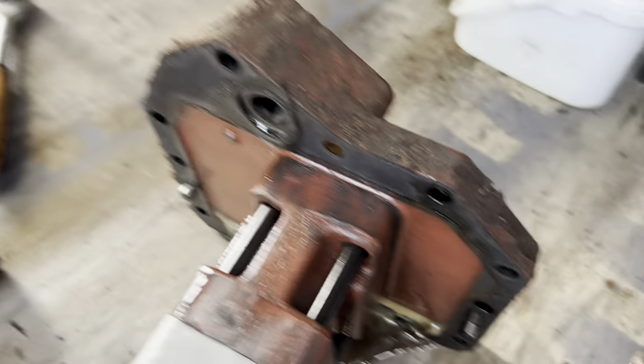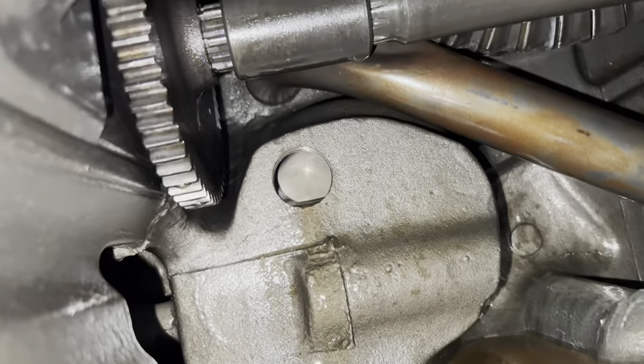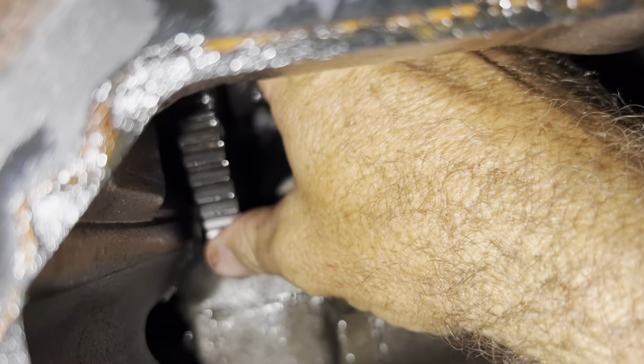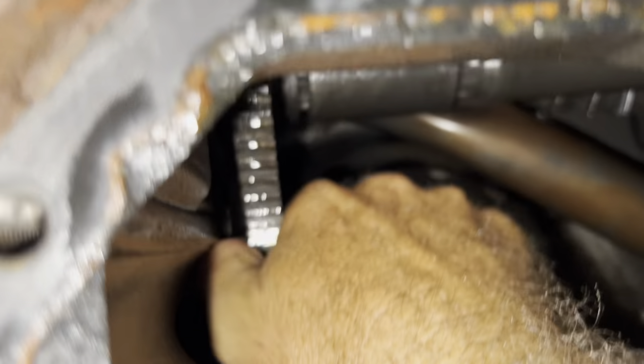Keep pulling it apart. I've just put my hand inside the transmission housing, not inside the pump. I think I might know where our problem is and, as per usual, I'm worried that it'll end up costing me more money than it's worth. I'm pretty sure it's not supposed to do this. So that gear there is the gear that drives the pump. Now I don't know about you, but I don't think anything in a transmission is supposed to have that much movement.